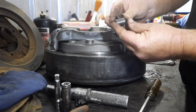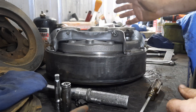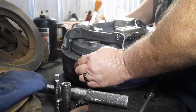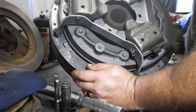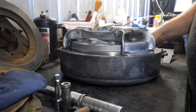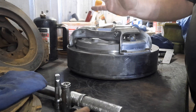These clips have little catches on the side to go up under the head of the bolt. I push them down and slide them back on — those are essential for the fingers to come back up. So that is the steering clutch assembly for the John Deere 450 BC — same as the regular B, but not the same as the regular C. That will conclude this video. Please like and subscribe, and maybe we'll get a video of actually putting this thing in. See ya.